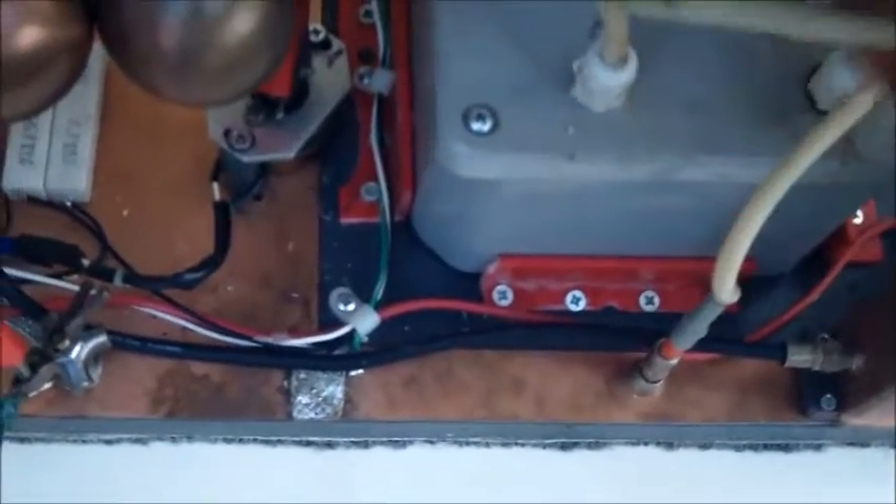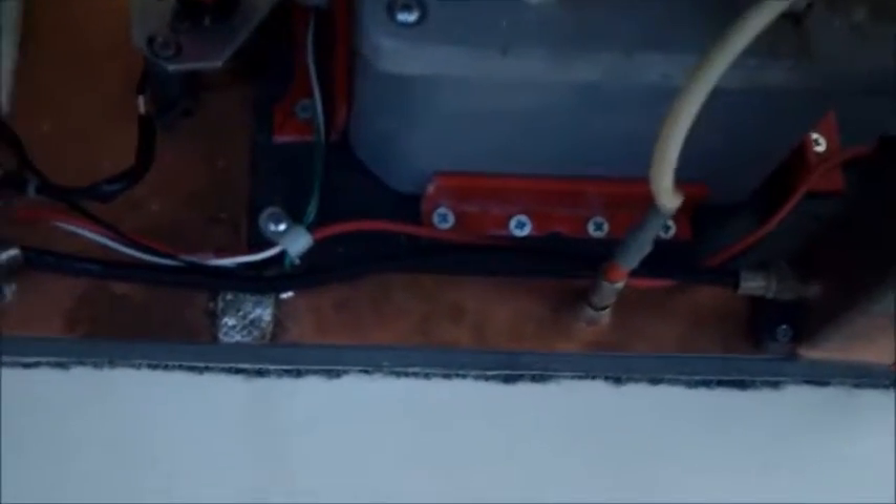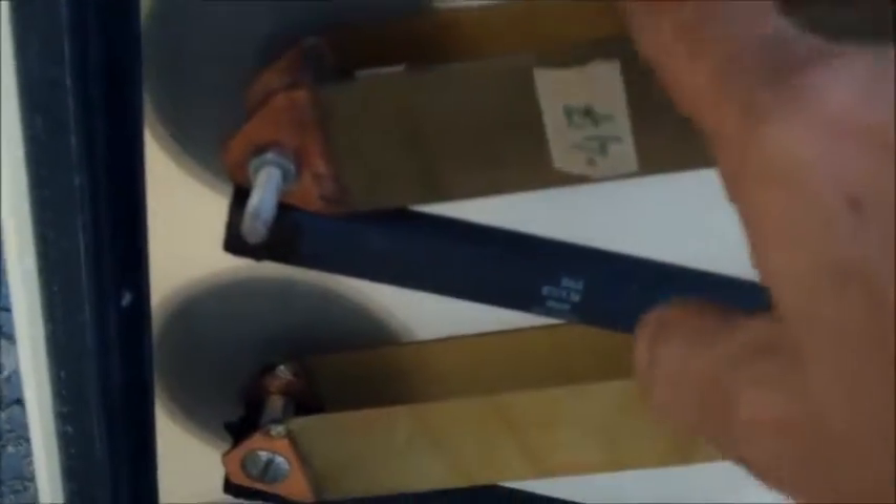The polarity change is accomplished by reversing these two wires at the outlet of the 40 kV power supply — the power supply is now reversed. These are the charging resistors. On this side we have the front resistors — two front resistors in series. We're using different values: underneath here are 100 ohm resistors, then 10 ohm, 10 ohm. All the back resistors are 100 ohm, and these are 47 ohm. They're relatively easy to change with a screwdriver or wrench.